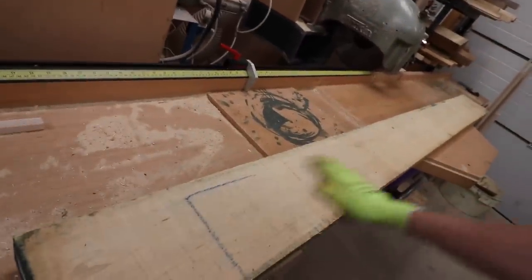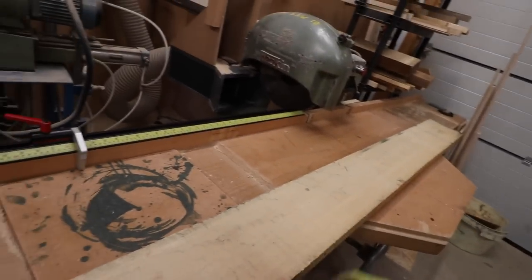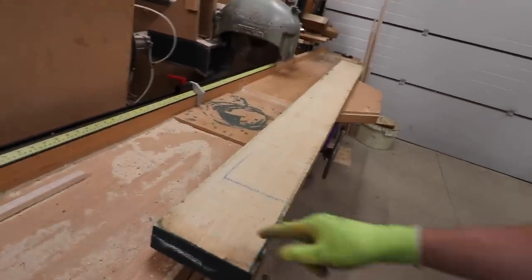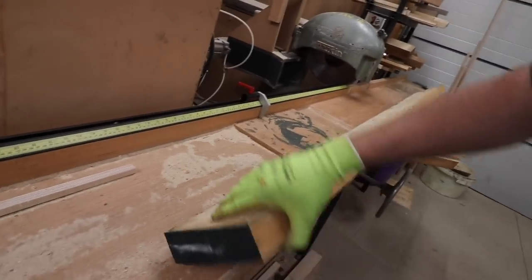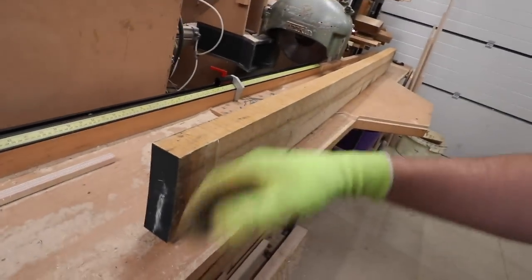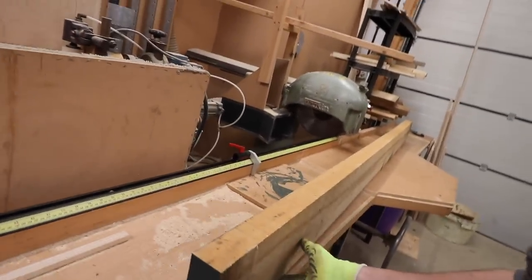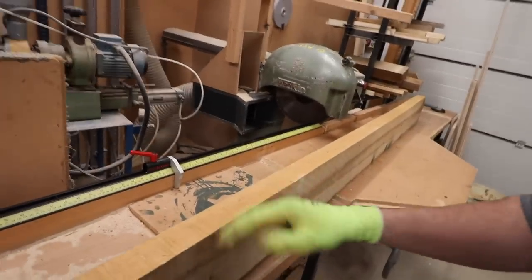You can stain it dark colours and it looks quite nice, but you've got to be a bit select as to what piece of timber you use, because some of them can have quite a dark purple stain or grain marks in them, and some bits can be really white and even grey. So it's quite a good variation on the grain. So if you are using it for staining, you've got to be a bit careful, but it's the perfect timber for painting, leaves a lovely finish.